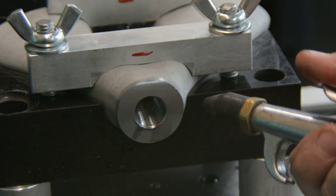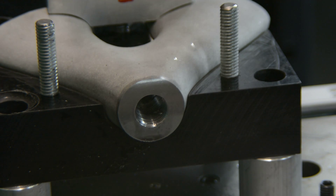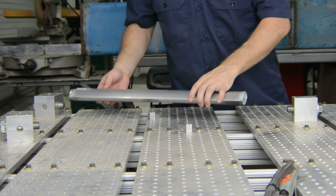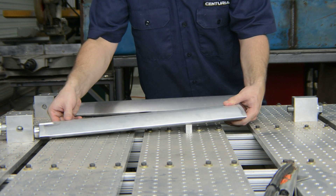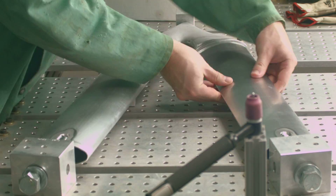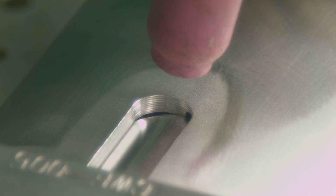This step is easy and very reliable and also very important. This tapped hole will hold the heim joints that attach the car's uprights to the swing arms. This fixture table was custom built by us on our CNC machines and is modular. Aluminum was chosen for the surface because of ease in manufacturing, weight, and corrosion resistance. The table turned out fantastic. Bolting straight onto the extrusion frames allows us to quickly and easily change the layout for fixtures.